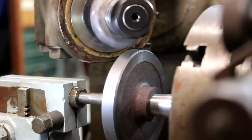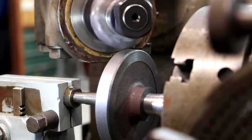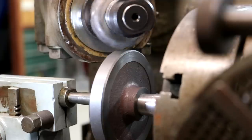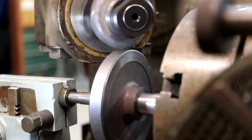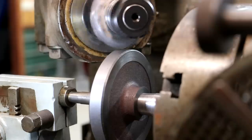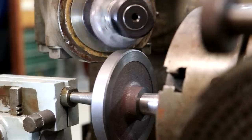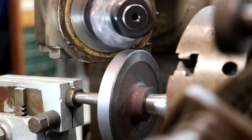Once we do, we will stop the feed and touch off on the part and get our zero. I have previously already set up to have the center of this cut over the center of this shaft, and we've already got all that set up. Because that did not change from my test cut to now, we won't have to do that again. So we'll let this feed on up a little bit more. I want to make sure we're not going to be touching in there. We are kind of over the gear now, so I'm stopping my feed and I'm going to raise this up ever so slightly until I just get a chip cut in there — doing this extremely slowly. It just barely touched the part, so now I'm going to feed back off and basically call that zero.